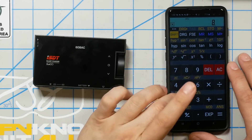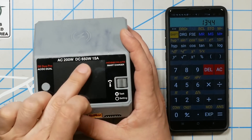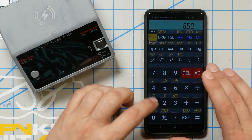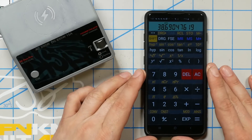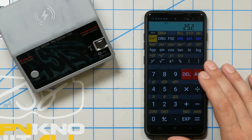How many watts would 8 amps be? 8 times 16.8 equals 134 watts. If we compare that to the HobbyMate D6 Duo, it does 200 watts and 15 amps off of AC. So the D6 Duo would be capable of taking full advantage of its 200-watt rating even when run off AC, whereas the 608AC would not. It's worth pointing out that the D6 Duo also goes up to 650 watts if you're running it off a DC power supply. 650 watts divided by 16.8 volts for a 4S battery is 38 amps — so it would run up against its 15-amp output limit. The practical maximum then would be 15 times 16.8 equals 252 watts.